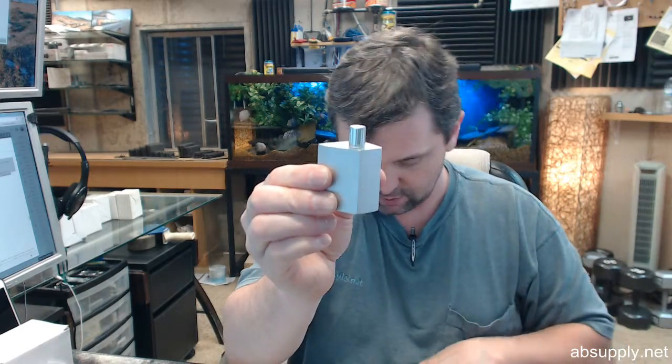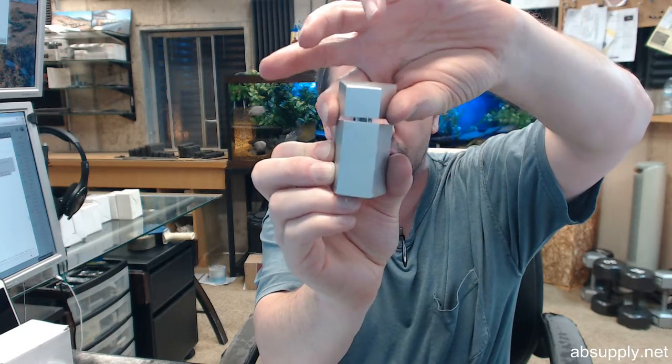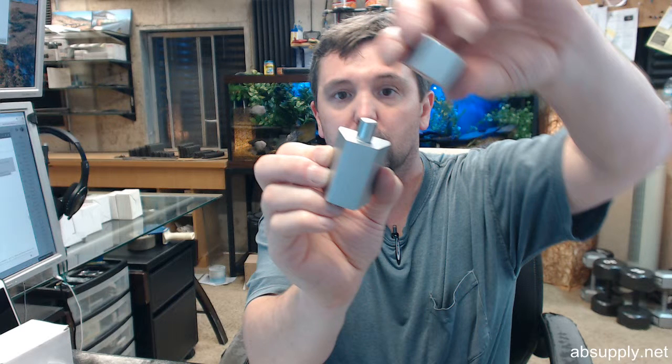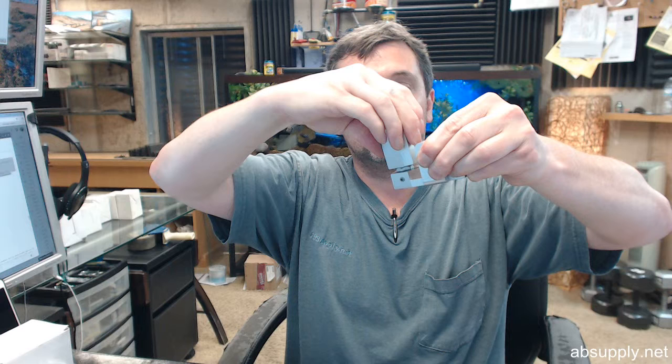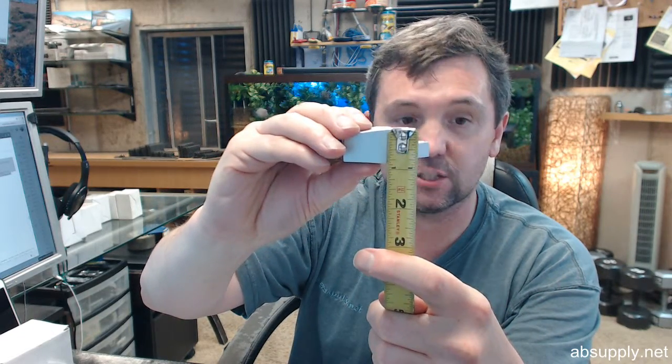Here is your top portion with the spring-loaded top pin, which will mate into the header portion. Properly installed you will have a 1/8 inch margin. Once all the hardware is installed, you get the door down onto the bottom pivot, set this, tip the door into place, push down and snap it right into the hole — and that is your installation. The header portion has an overall depth of about 2-3/16ths and a thickness at maximum of about 7/8ths — again a 3/4 inch offset.